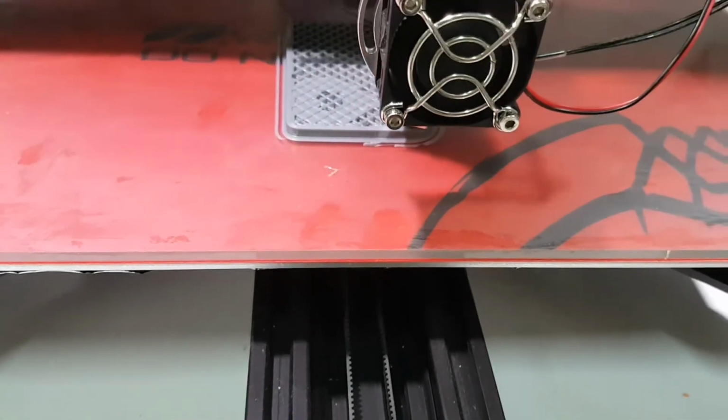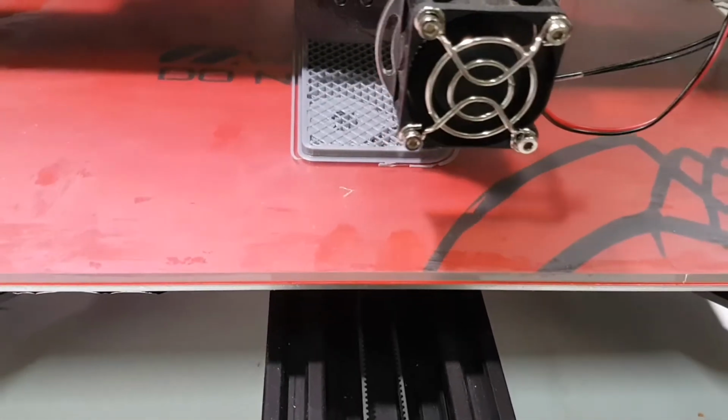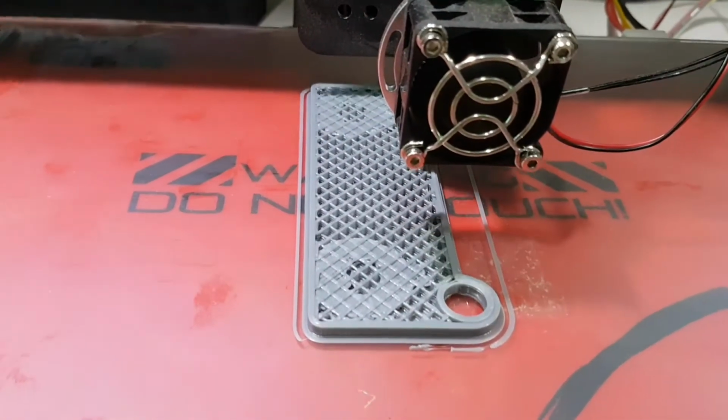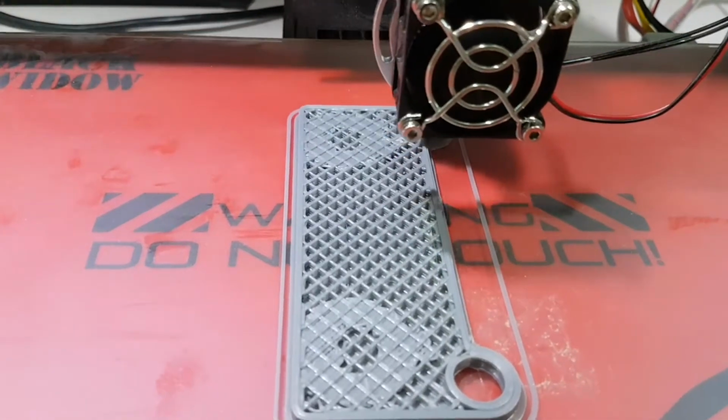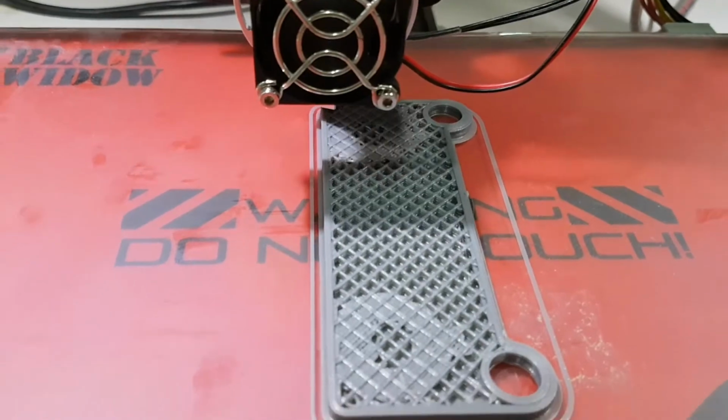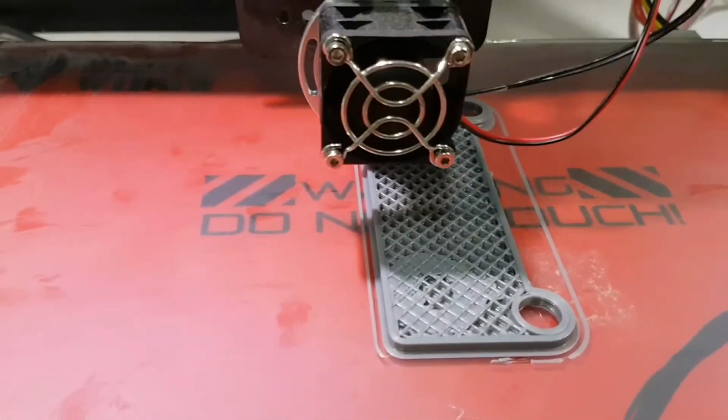The current set for the y-axis, I bumped up a little bit higher. It was set at 1000, which I guess is just 1 amp, so 1000 milliamps. I bumped up to 1400 because it did actually jam and lose position on a print.